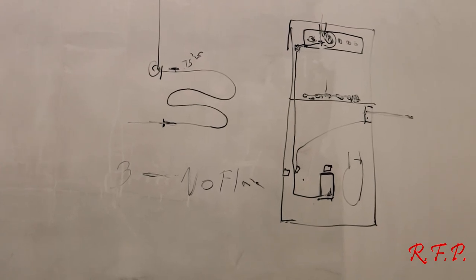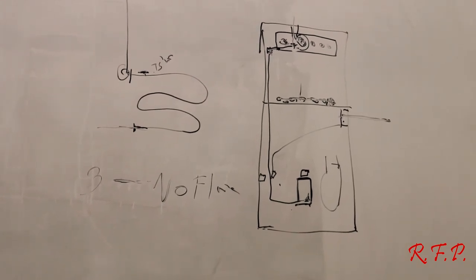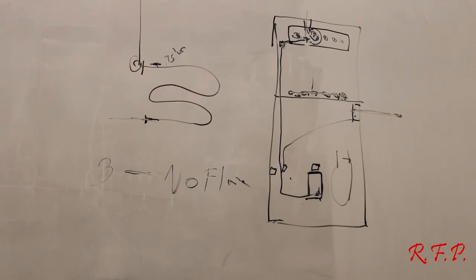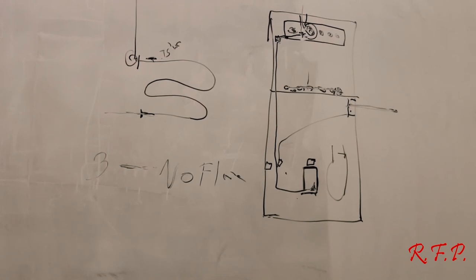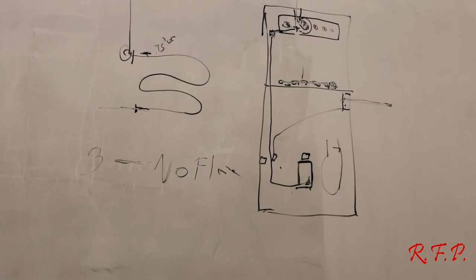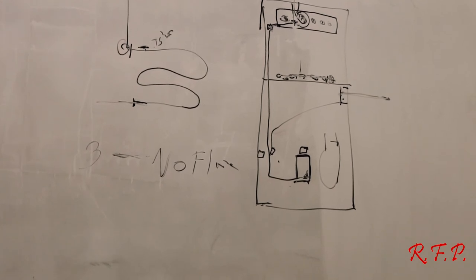So what I'm trying to say is, do you have to change out any of those pieces? Like the rod. Well, the rod, I'm hardly ever going to change out. It's got to look pretty bad before I'm going to need to change it. It's got to be eroded from the flame. If it's really pitted or rusty, then I'm gonna consider changing it out. The main thing I wanna know is it's clean. You're hardly ever gonna find a rod that's in bad shape. It's got a ceramic insulator around it. If the ceramic gets broke, I'll change the rod out.